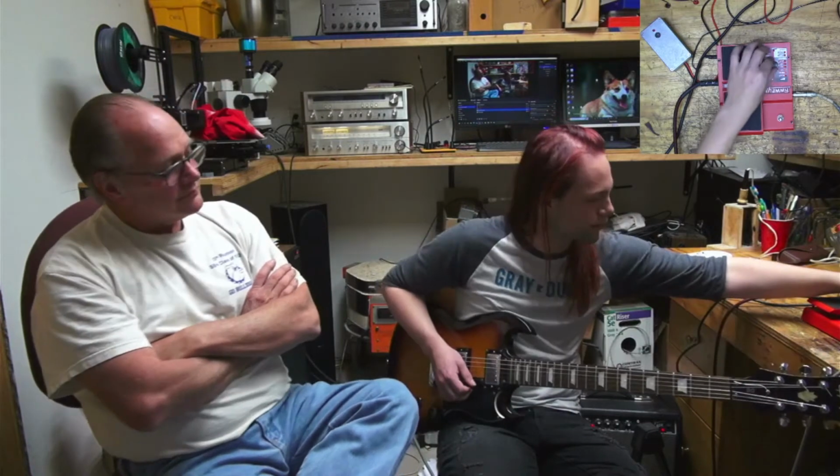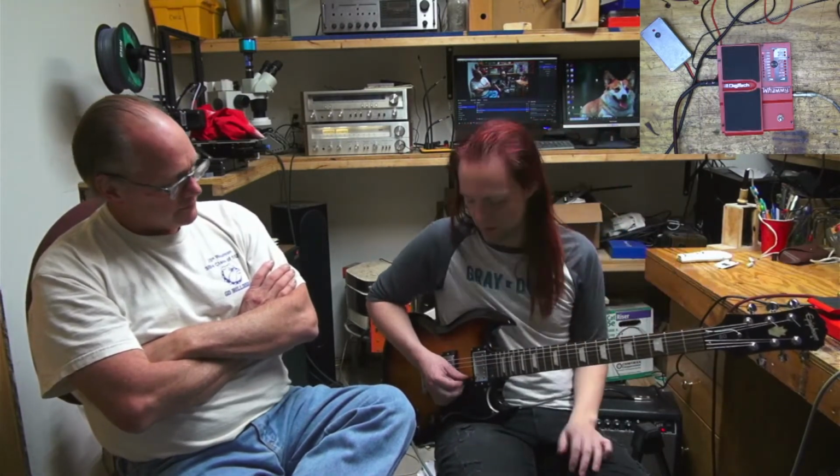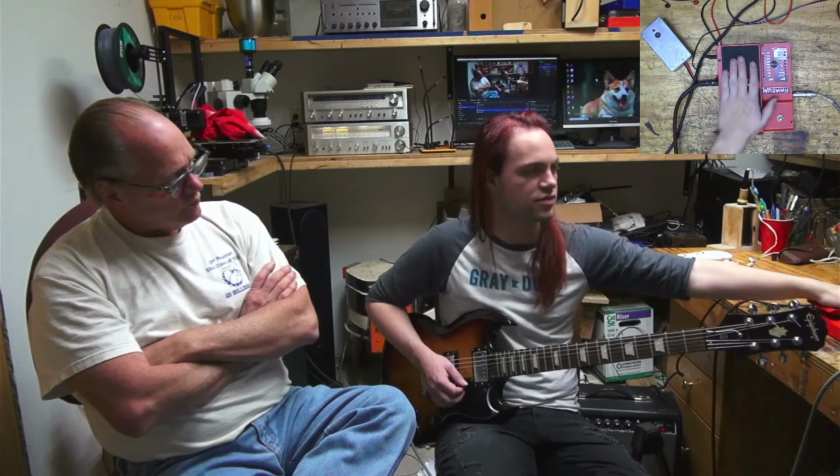And those signals are mixed. It depends on what setting you have. The way that we are figuring out the problem comes from the mixed one, because it's so much easier to hear. You can hear both the normal octave and then the higher octave as well. But when you bring it down and have the pedal all the way down, it should hypothetically do nothing. What it does is that instead of mixing 440 with 440, it'll have 440 with like 432.